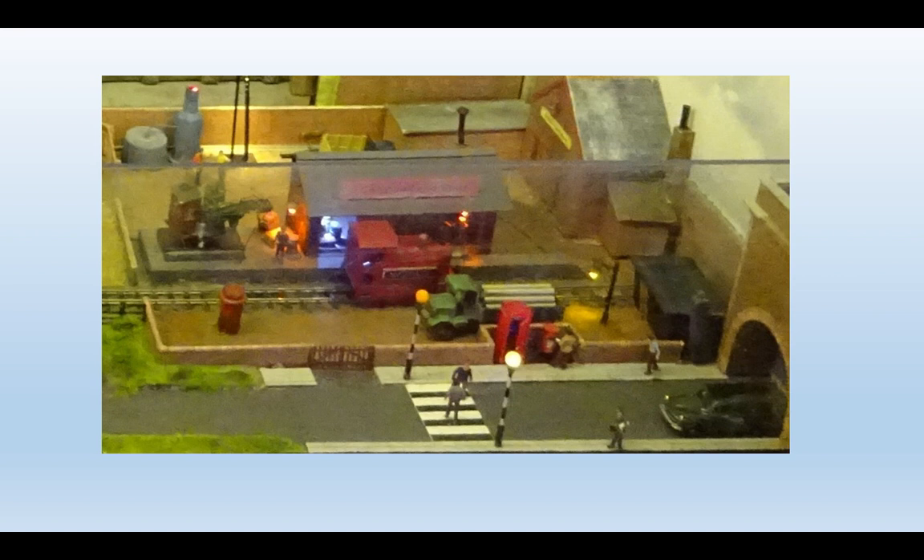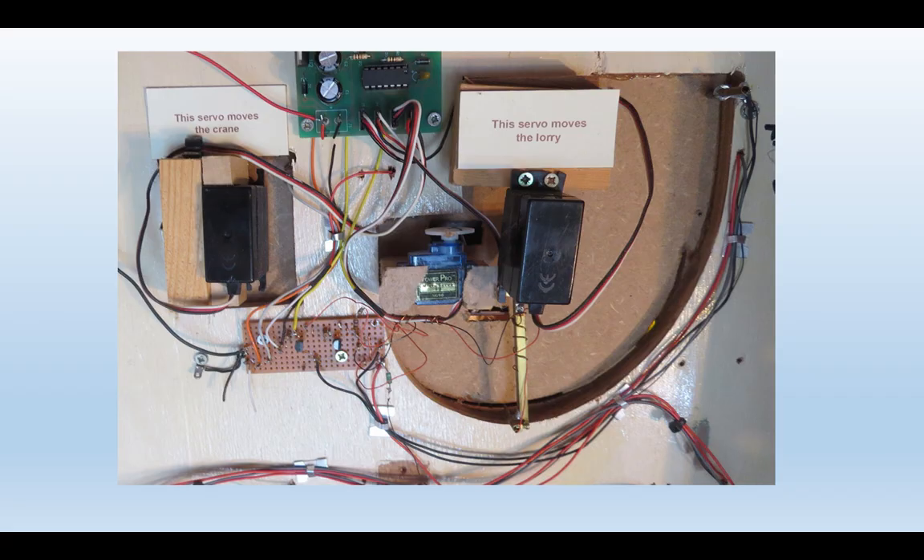On one of our demonstration layouts, there's a die-cast lorry parked behind the shed that has to come round in quite a sweeping arc — a heavy weight and a wide arc. Underneath we used a more powerful servo and replaced the plastic horn with square brass. The smaller SG90 to its left has a lighter load — it just opens a door and therefore doesn't need the same amount of torque.